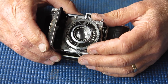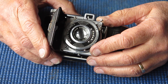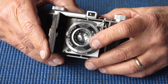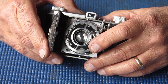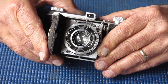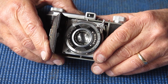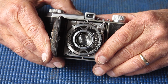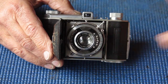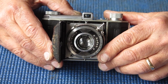I've only seen one image taken with this camera, and that showed no signs of light leaks. There was a fair amount of flare — looking at the image I could see where the flare had probably come from, and looking at the state of that hazy lens, flare would certainly be a major cause of problems. Particularly with a high contrast image, a bright light source like the sun, or an indoor light source off to one side just outside the normal film area, striking the lens obliquely can light it up and destroy contrast.